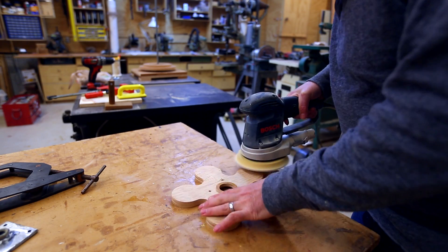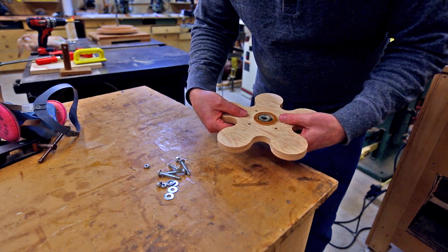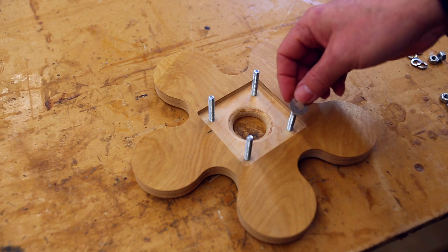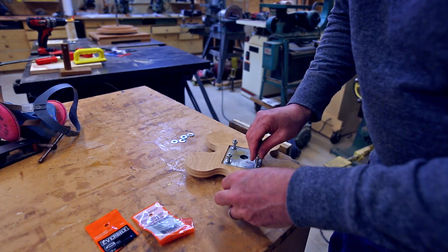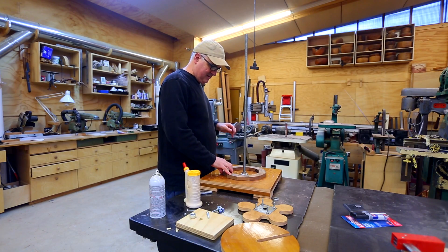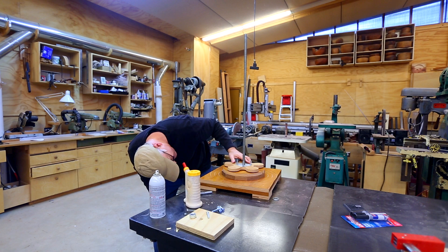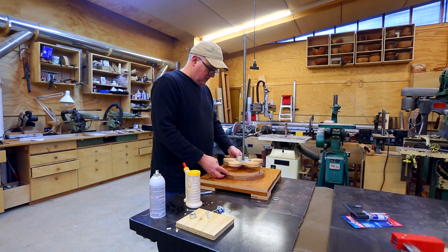I sanded the surface I had taken down on the CNC machine and attached the metal piece to the wooden piece. The first time I did this the metal piece was a little crooked to the wooden piece — the bolt weld wasn't perfect — so I added two washers between the metal and the wood to get them more planar, then tightened the bolts. Testing it on a small ring with the bearing plate, I threaded the handle on and it's pretty balanced with little wobble, contacting the bearing plate fairly evenly.